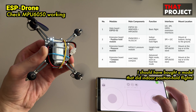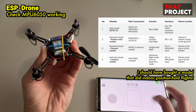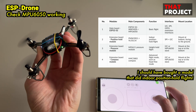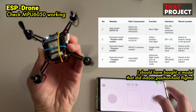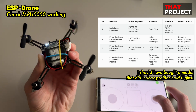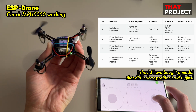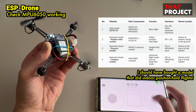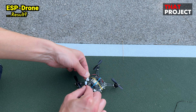This model is the most basic one and its functions are limited to basic flight. Since it has an MPU-6050 sensor, it basically collects data for the accelerometer and gyroscope. This is the most basic sensor for a drone — without it, it would probably be almost impossible to fly. This test is about how the motors operate depending on the tilt of the drone. When I intentionally tilt the drone in a sudden direction, the motor in the tilt direction does not operate, which balances it by forcibly controlling the motor in the most-tilted direction.